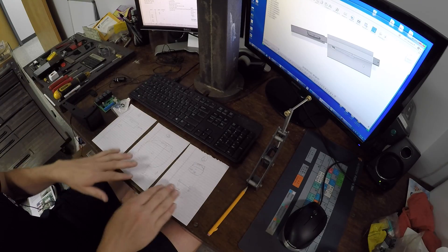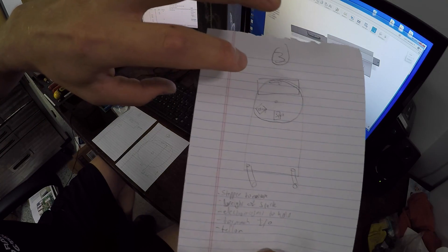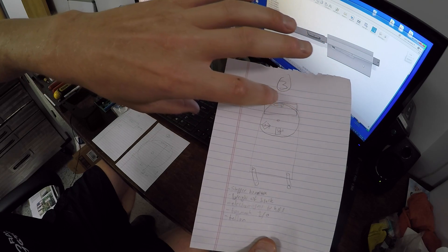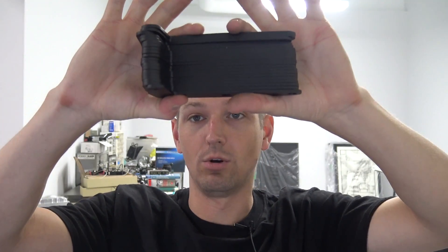That was my first rough sketch — I know they're kind of pathetic, but it actually worked, which is amazing. I started thinking about the size of the disc and the enclosure opening on the 440. I even thought about a big donut that would weave through the 440 panels, but that got complicated. By the third sketch I really started to like it: engraving point at 12 o'clock, rotating to 7 or 8 o'clock for a drop through a feed chute, picking up from a stack in the back, then rotating back. I realized the rotary table needs to be mounted on a plate that extends down to the floor with posts for stability, because the stack of parts will have considerable weight.